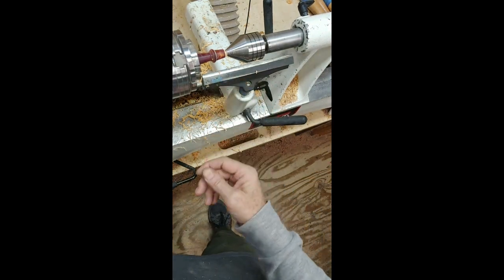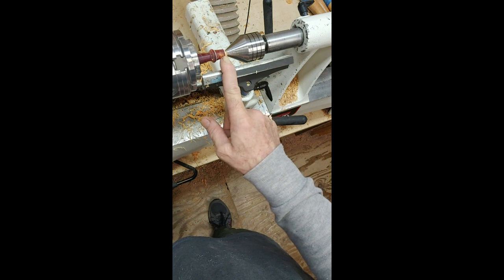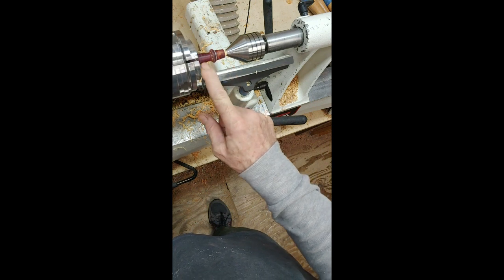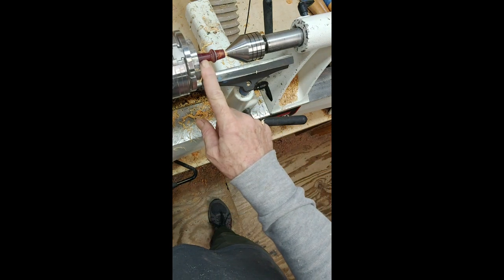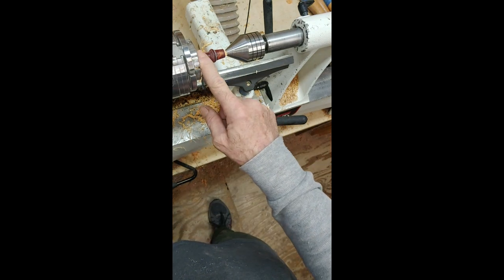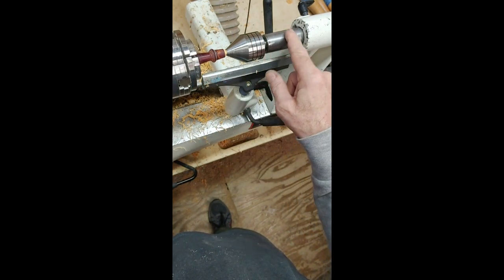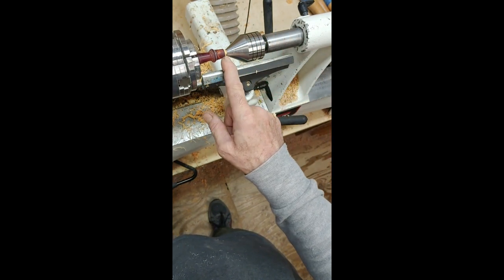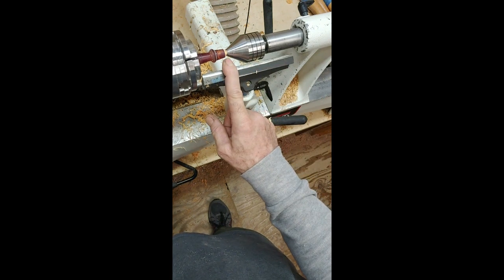Okay, this is probably a decent shape. So this will sit down in the little cavity of the recess that I'm going to make on the end of the mortise. I've gone as far as I want to go on the diameter here. Ideally, this will be a little thinner, but that will be taken care of when I turn it or grind it on the wheel. So I'm going to go ahead and change out this tool, put the drill chuck in, and chuck up that 10.2 millimeter bit so that we can install this tenon.